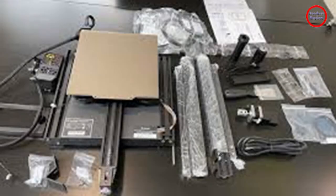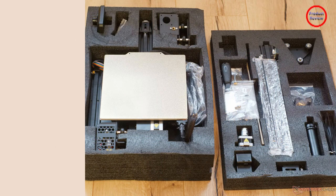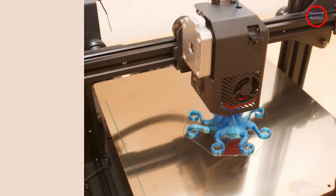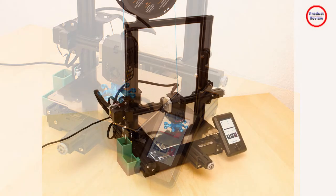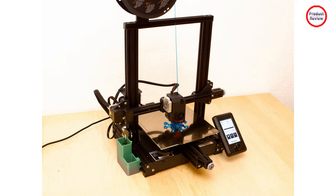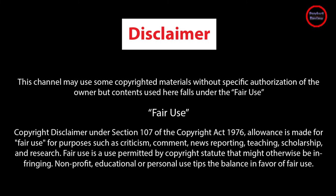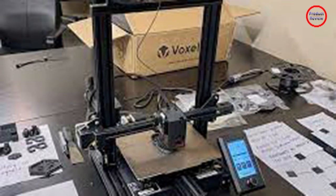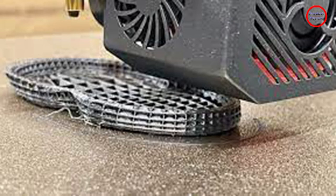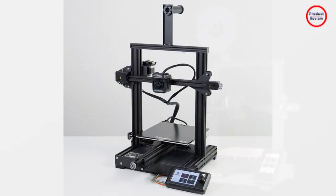A Nation N32G455 controls our test device. With this somewhat unusual 32-bit microcontroller, the 3D printer performs well. This controller features a 32-bit ARM Cortex-M4 with 144KB SRAM. The variable memory is thus sufficient for mesh bed leveling and other advanced features, should one decide to upgrade the hardware and firmware. Our test unit is the N32 version of the Aquila S2; there is also the slightly cheaper H32 version with a different microcontroller. Although the microcontroller is not officially supported by Marlin and other open-source firmware, there are some versions available, including a Marlin version from Alexxd on GitHub. However, the original firmware from VoxLab is basically sufficient.